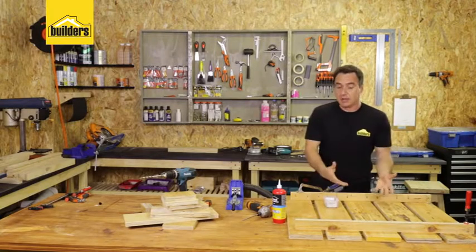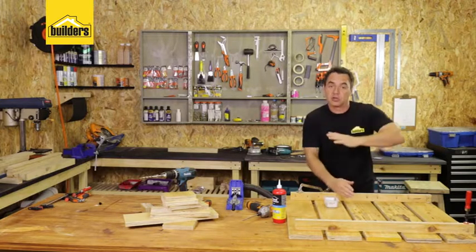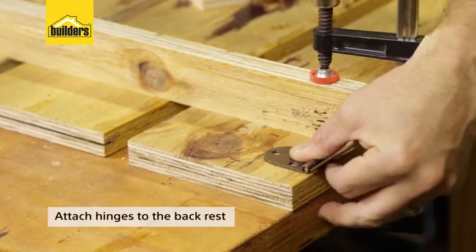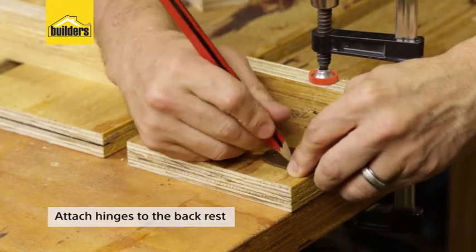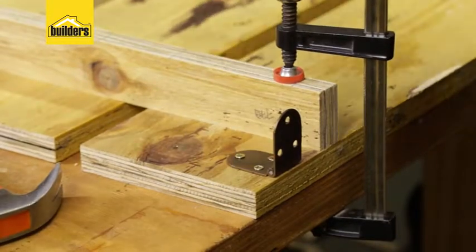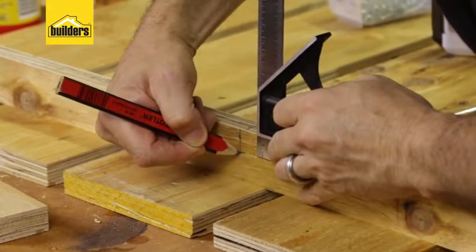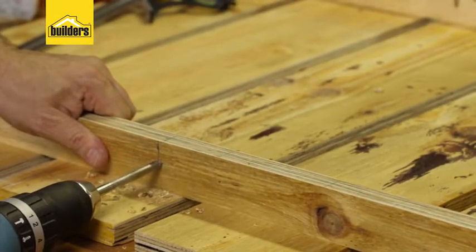Whilst I've got it in position and upside down, I'm going to put on my hinges and drill the hole for the pivot, which is going to have our adjuster so we can have all the different heights on it. I've used two flat hinges. Remember, this is overhanging over the edge of the box frame, so you're going to have to allow a spacer before you put your hinge in. I'm going to measure 355mm to my pivot point and go down 20mm, then drill with an 8mm drill bit because I've got an 8mm bolt which is going to clamp the pieces together.